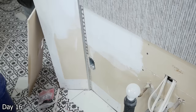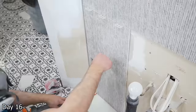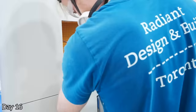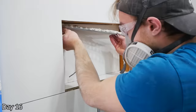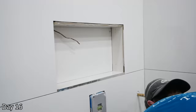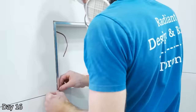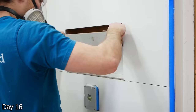Got the final accent tile here. We got a little outlet down there as well for a possible warming basket that they might get in the future — just cut out around that and pop this in, and then moving on to the niches. Starting off with all my niches — I like to get the bottom tile, pitch it out ever so slightly, get the back tile on there, and then do the top and the sides. Since we have the LED lighting going in, I get the Schluter Deco SG profile in the top there first, just kind of silicone it into place. Then get that top piece in, get the sides to support it, and get my metal profiles in. I miter them for that sleek finish. And in this case my cut line wasn't absolutely perfect, so I'll actually have the metal profiles pop out from that tile maybe about 1/32nd of an inch — that way, after the fact, I can go with some silicone that's the same color as the grout and tidy it all up for a really nice, perfect straight line.